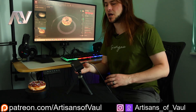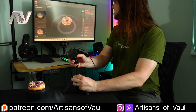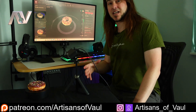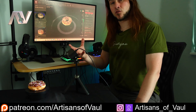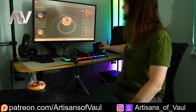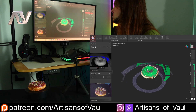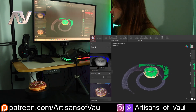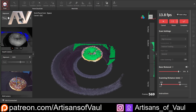Now, what I want to try and do is capture the hole of the donut — hole starting with an H, not with a W. So we're going to change the angle here, just go a little bit higher, and make sure that everything is still on that excellent to good sort of distance. Now, normally with another 3D scanner, I'd be a bit dubious doing this. I'd probably go through most of the processing and then stitch multiple pictures together. But the tracking on Revopoint scanners is generally really good, and on the Pop 3 Plus it's meant to be absolutely fantastic. We'll click start and it will say tracking loss, but it's picked up the features almost automatically, giving us this vastly better angle. So we're just going to let it do one rotation and then pause and complete without having to do multiple separate scans.